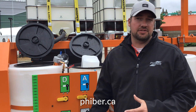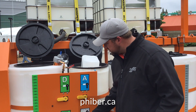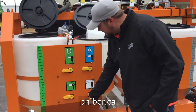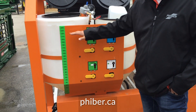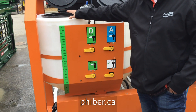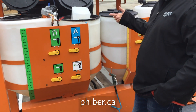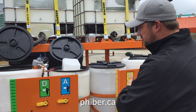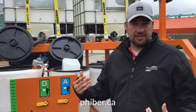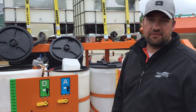To clean out, it's quite easy. Normally you're sucking fresh water and rinsing with fresh water, but we can change that source to pull out of this tank here. You fill this inductor with water and put your cleaning agent in here — whatever it is, Finish All Clear or whatever you use. Then you turn on all your rinsers and it will wash all your inductors down with that cleaning solution. Then you open them all up, send them over to the sprayer, and it will clean your sprayer as well — cleaning all the plumbing through here and flushing out your sprayer with that same water.